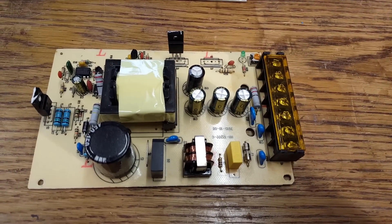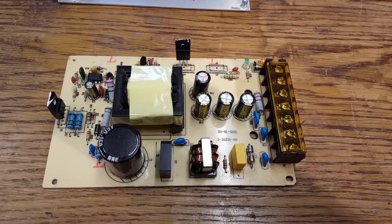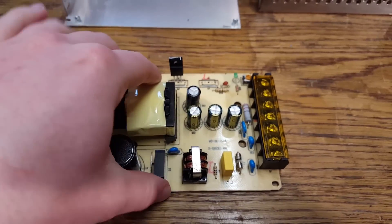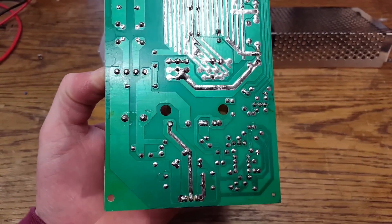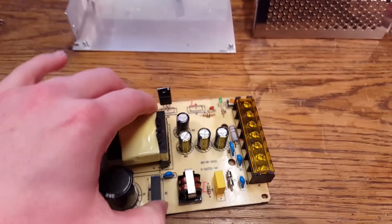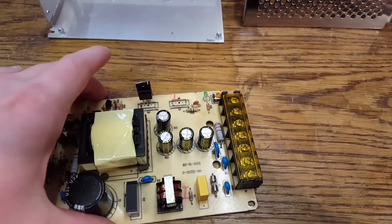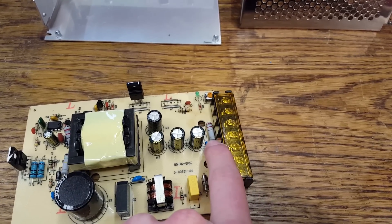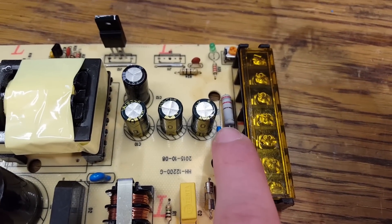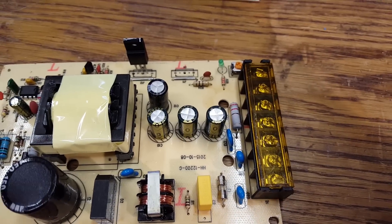This is the main circuit board, and I could not keep my hands from it and had to correct some of the issues. The soldering is actually relatively good — can't complain about that. But these are the output filter capacitors, which are in parallel to the output. This is the load resistor. These switch mode power supplies do need a minimum load to work properly, and that's what that resistor is for. It's also connected straight across the output.